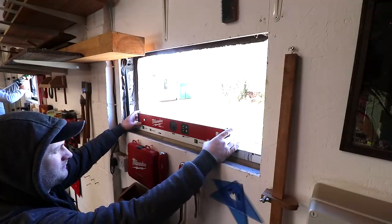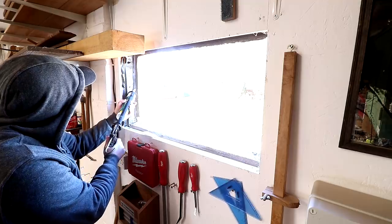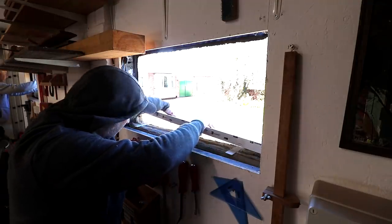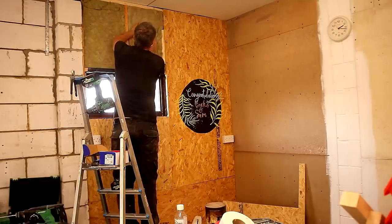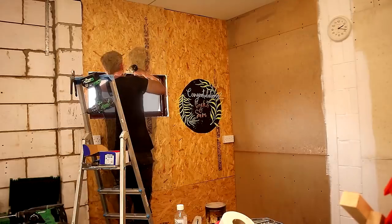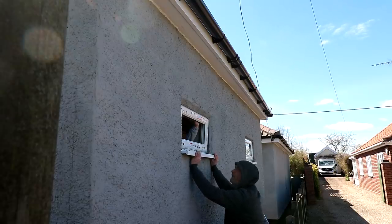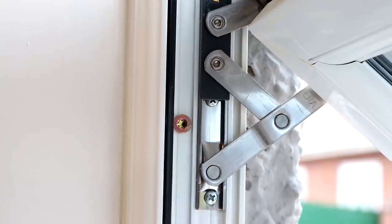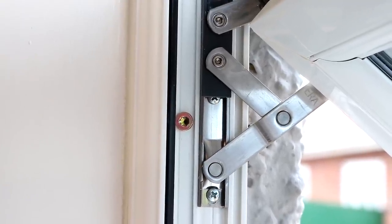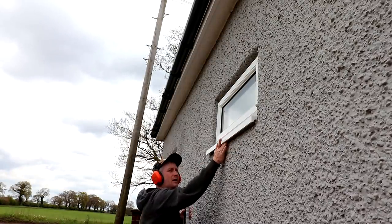I checked it was sitting level and it is. I added a generous bead of clear silicone to seal it against the old render, and some under the window sill too, and we added some packers underneath just to lift it up. Because I'd already framed out the inside of the walls many months ago, it was a little bit awkward to get the window into the opening, but pushing the window in from the inside and pushing the window sill in place from the outside worked nicely. A couple of Torx head frame fixings through the sides of the frame going into some brown wall plugs in the Thermalite block wall holds everything securely, and I can then seal up the outside with more silicone.